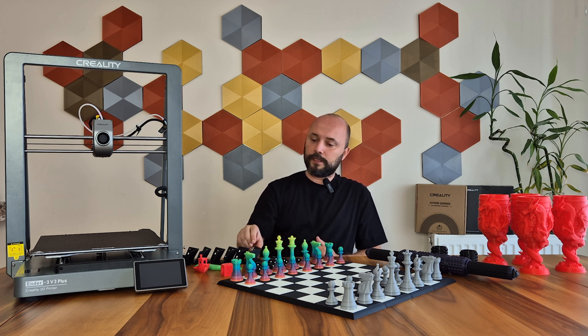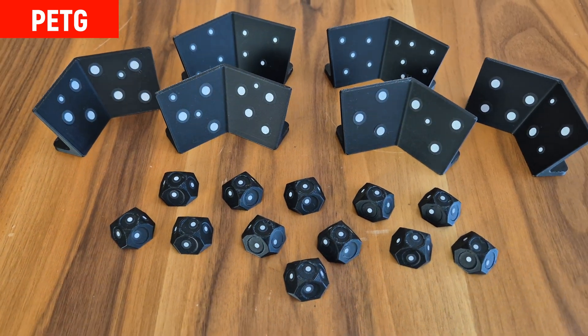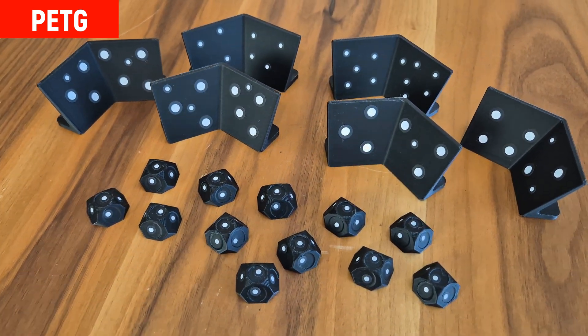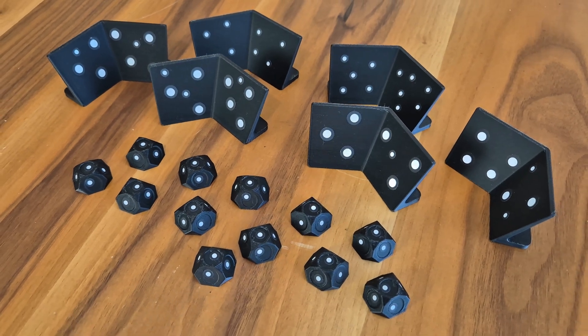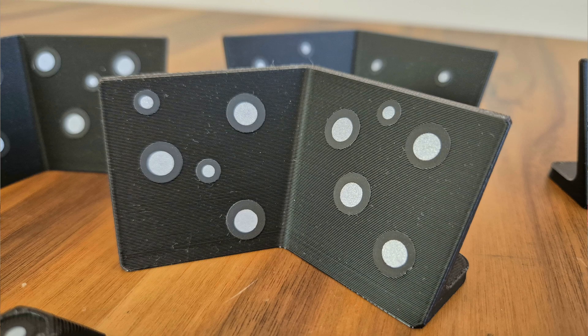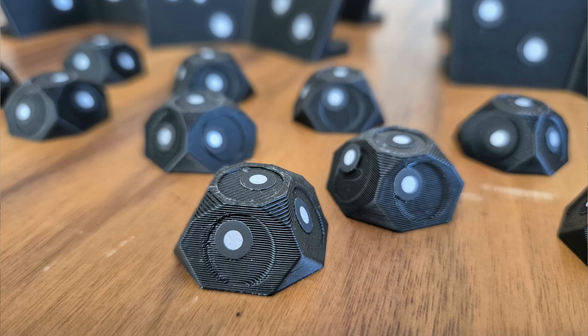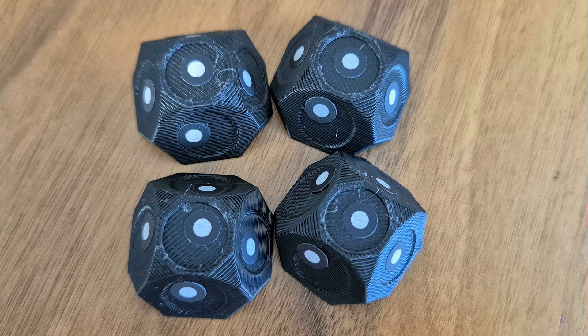Overall, I liked all the printings, but the surface quality of PETG particularly impressed me. I got a few more printings according to my needs — these pieces are useful as reference points to avoid losing track while 3D scanning. The dots you see on them are not the color of the printing but reflective stickers that the scanning device detects to track the object. I quickly made these printings at a layer quality of 0.3 mm and liked the result. The layers look quite flawless, with no nozzle marks visible on the top parts.